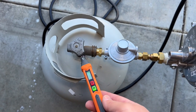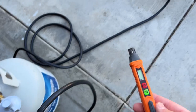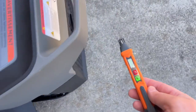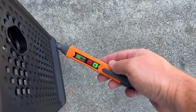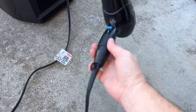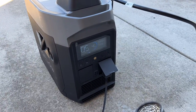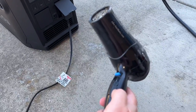This is a good time to do one more leak check. This part should be under pressure and this part has a slight vacuum as it gets drawn into the generator. Still nothing detected — make sure the pin is working, and yes, it goes up to the red, so the detector is functioning correctly. Now we'll set up the load adjustment block with an actual load using a hair dryer — first a low load, then a high load.